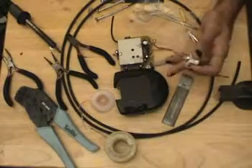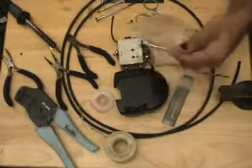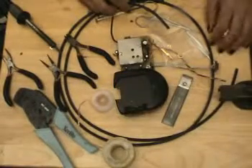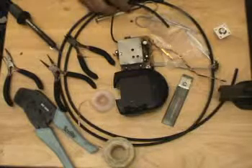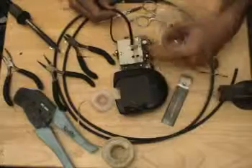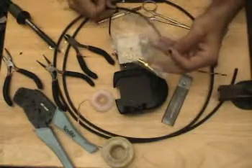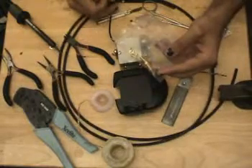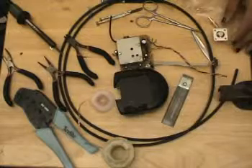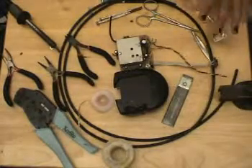Here is a female panel mount N connector and a crimp-on female reverse polarity SMA for LMR195. When you get your coax, make sure you get the proper connector for crimping on. I'm not going to get into the process of using the crimpers — there's plenty of information on the internet, and I did a segment on Amateur Logic, episode 12, on making homemade crimpers. What I'm going to do is first solder a length of this inside the RF box of this receiver, with a short length of cable leading into this female connector. You have to remember that radio acts like water — if there are any holes or gaps, any break in the shield of your coax, signal will leak out.